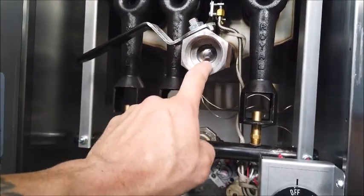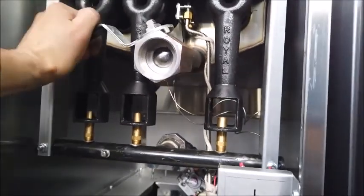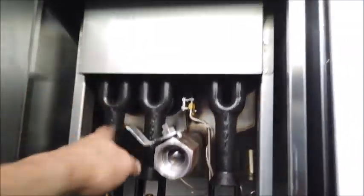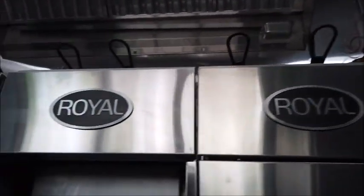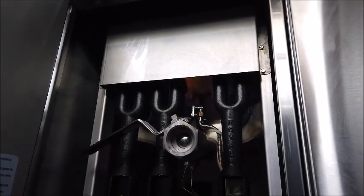Also, again, in the paperwork bag with the legs, drain tube goes in here, open up and allow to clean the oil out of the vat. Never transport with oil in the vat itself because that is very dangerous. Again, thermopile lit, it's in the on position.